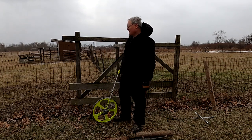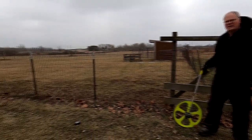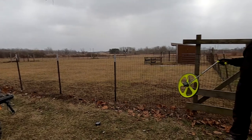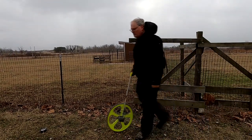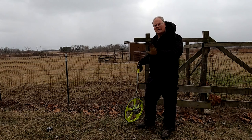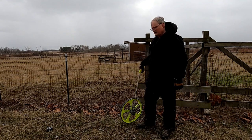I think these are like 6 foot apart. So I'll go between 6 and 8 foot apart. If I'm using this fence, you can go farther apart, so I can probably push 8 foot, which I have done in some cases. If I'm using the goat fence, which is 3 inch squares, 4 inch squares, I like to put them closer together because it's more flexible. And if anything pushes on it, they could push it out. 8 foot is just too much, I think.